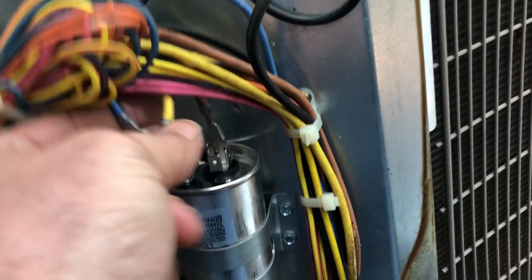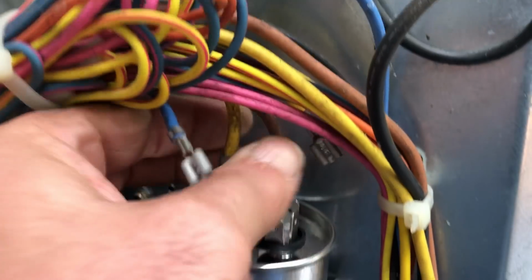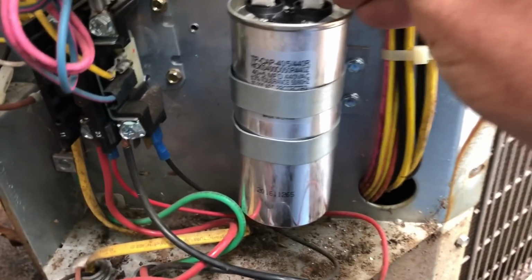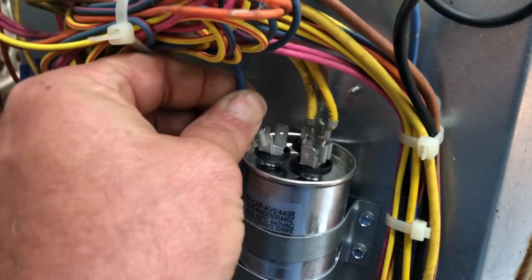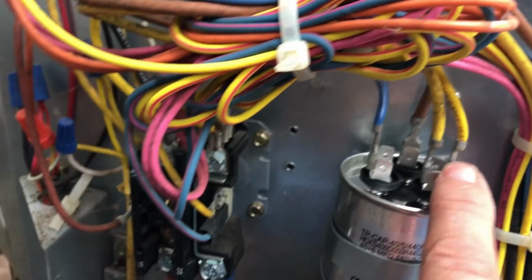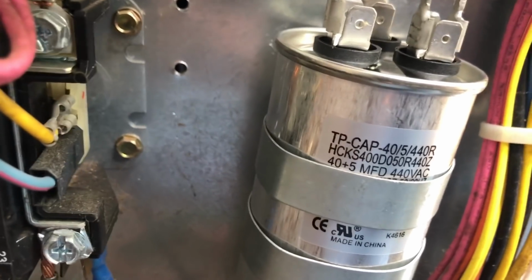So hopefully our wires will reach right down here. The brown goes in the back, so I'm going to hook it on first. And then the two yellows go to this common right here. And hermetic is right there. The one with 3 on it. The common will always have 4, and the fan will only have 2, with most of them anyway. And as much as I tried to leave that thing up, well, yeah, you can still read it.